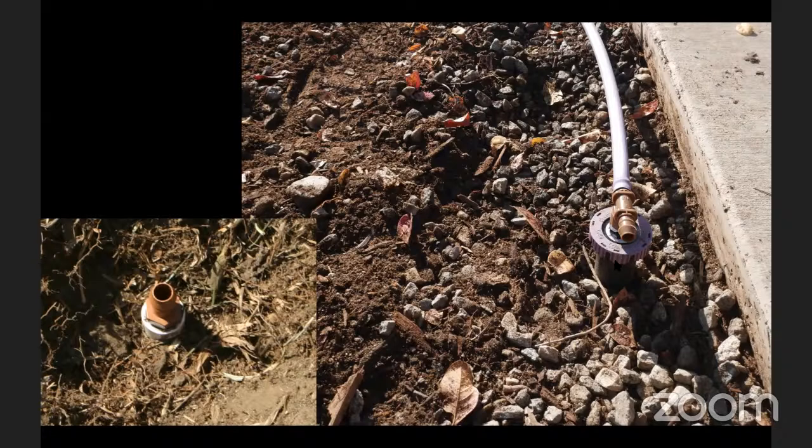And you want to check and just with a hose, flush out any grit that is stuck within this filter, ideally every 6 months, at least every year. Our city water is pretty clean, but sometimes if there's work on main lines in the city water distribution system, some grit gets into it. And so eventually that will need to be flushed out.